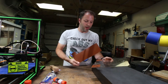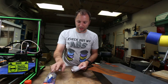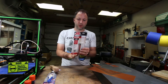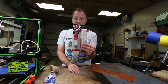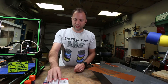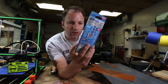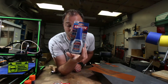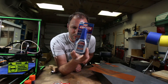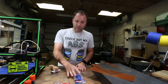So this was kind of my test piece — I cut small sections out and attempted to apply it to the build plate. I went to the hardware store and looked for some different epoxies I might be able to use. I purchased some JB Weld Clear Weld — this is actually recommended for plastics, fiberglass, and glass. It has a nice little mixing container. The other one I went with is this Loctite Go2 Glue, which should be available from Amazon as well. It's repositionable for five minutes, which is what I was looking for, and it takes a set in 30 minutes. This is also recommended for glass, plastic, stone, wood, and other materials.